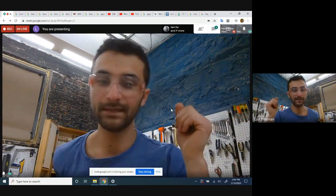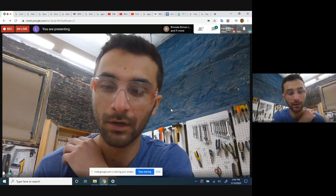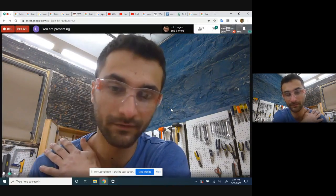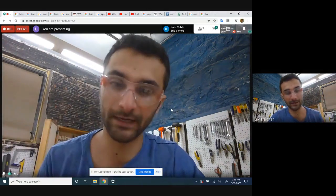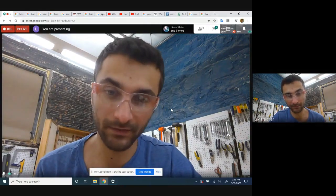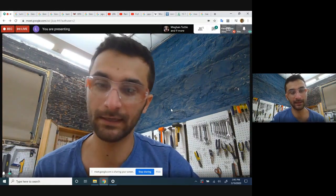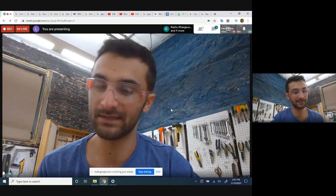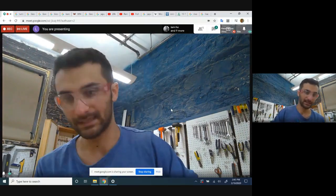In terms of general safety, the two things I think are structurally important are: learning how to use a tool confidently with proper respect for it. If you're holding something really timidly it'll just get ripped right out of your hands — that's more dangerous than really confidently holding on to it. Similarly, being overly confident without enough respect for the tool could also get you very injured. Not fighting the tool is really important — that applies to both hand woodworking and power tools.